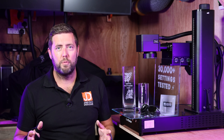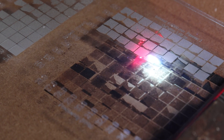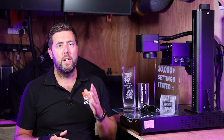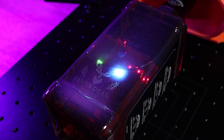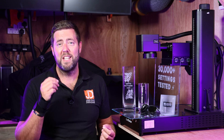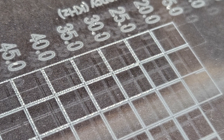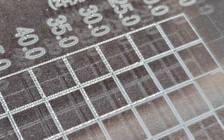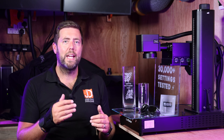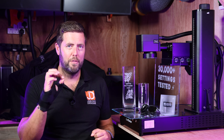With frequency, it was a slightly wider range — between about 25 and 40 depending on the glass and settings. Realistically, I found myself somewhere in the middle between about 30 and 35, and you're probably going to have better results from that. Just to link Q-Pulse and speed: if you have a low speed like 10 or 20 millimetres per second against a low Q-Pulse like one or two when doing outlines, you may start to see tiny dots along the outline. So you probably want to keep the lowest speed above around 30 or 40 millimetres per second to avoid those micro dots.